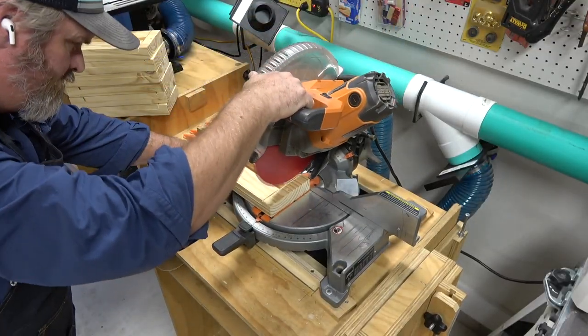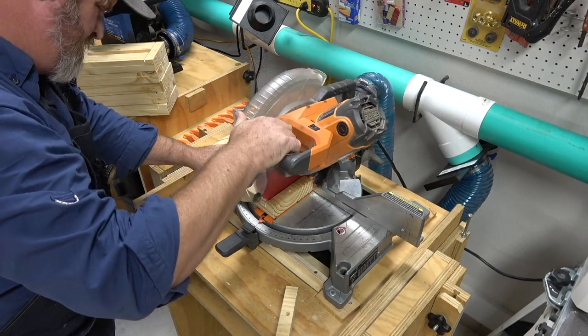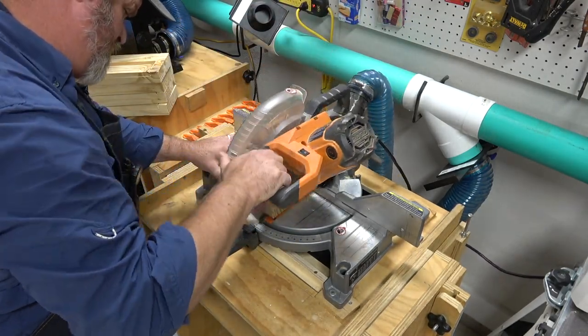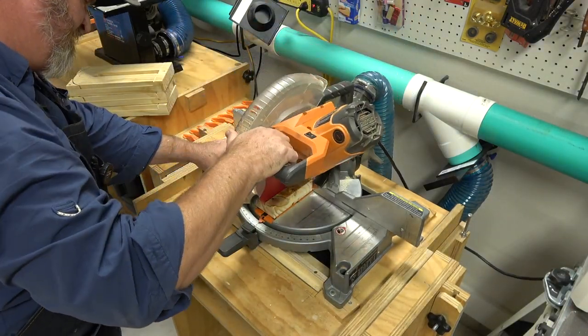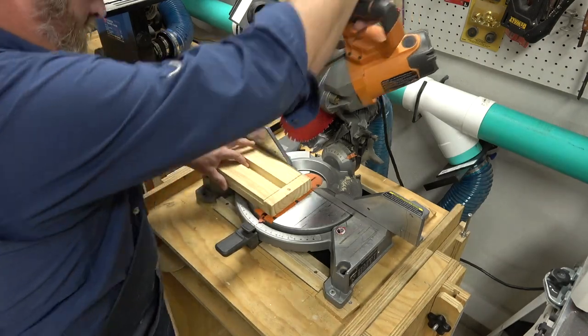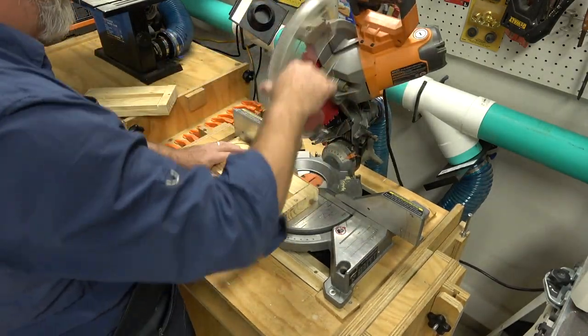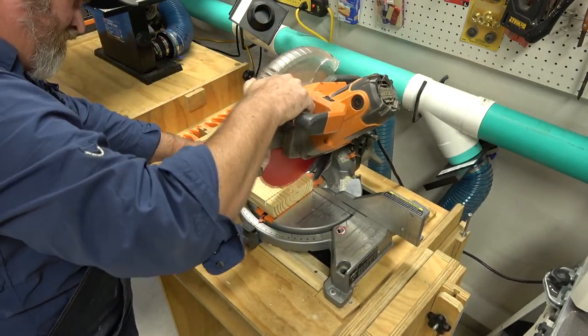Back over at the chop saw, I don't have to wing it out anymore because I did a top carve only about a quarter inch deep as a guideline so they're all the same. When the saw is not flipped out I have about 30 inches over to my band saw — it makes quick easy work without having to fold it out every time. Just flip the dust collection on and keep on cruising.